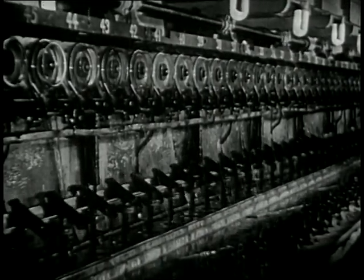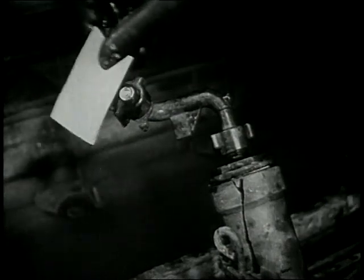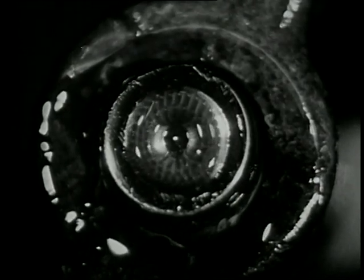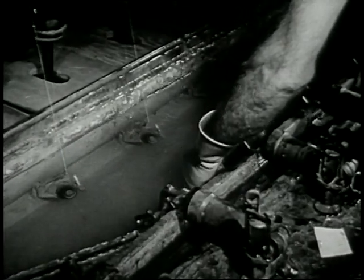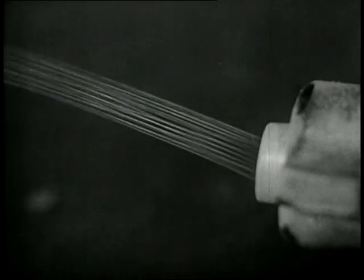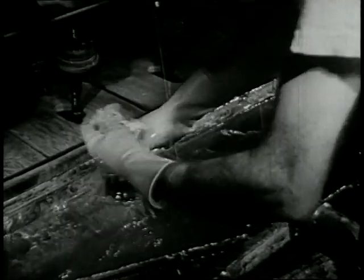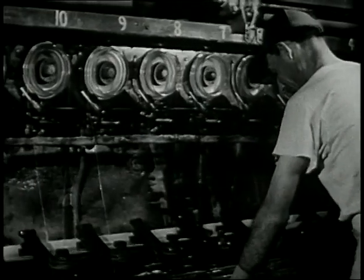Now in the mill, they do the same thing on this spinning machine. This machine has many spinnerets. He's lifting up one of them now. This is the spinneret. And if we look closely at the end of it, we see it has many tiny holes with liquid oozing out of them. Now he's putting the spinneret down into the acid bath. And here's the fiber forming. The liquid is forced out through the holes in the spinneret to form these filaments. The filaments are drawn together into a single fiber. And this is twisted into a strand of rayon yarn.